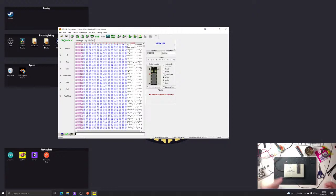It might just send the voltages up the pins to erase the memory cells, and then not check to see if it's erased. So I'm not going to read too much into the fact that it erases but won't write. I'm going to try a double write on it.